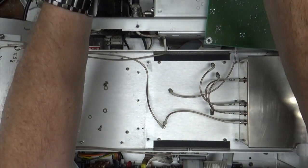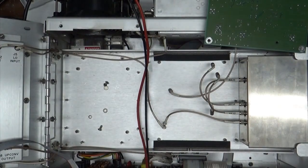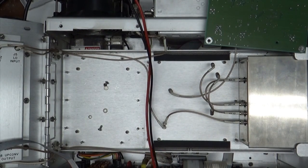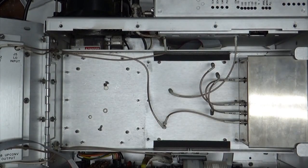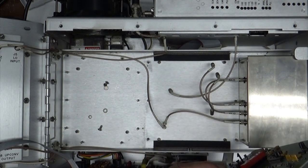Take the meter, and on ohmages, 47, 48, 46, 50. Wow, I got two that were actually right. Okay, we're going to go with it. 3 ohms really probably isn't going to make that much difference. Okay, but double value will, that's for darn sure.